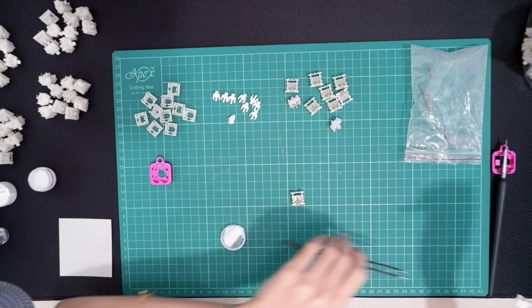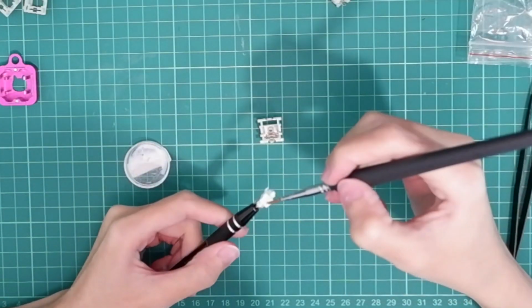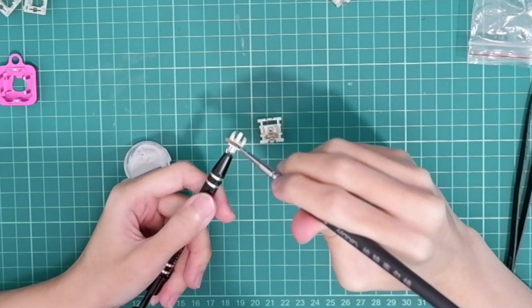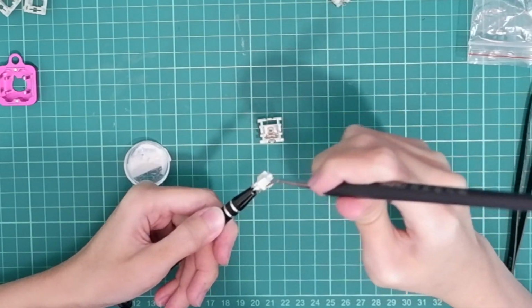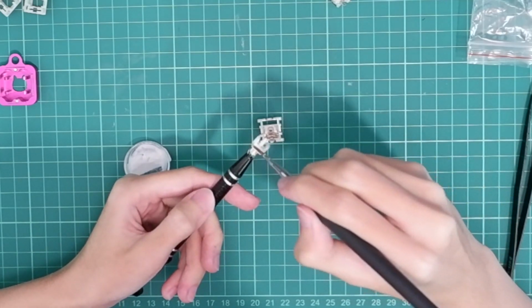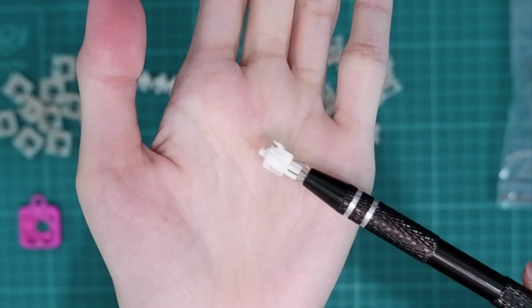For the stem, I use the same amount as the bottom housing, a rice grain size spread evenly. Put one swipe on each side of the stem, then spread it evenly. Since my switches are silent, there's a rubber top that should be avoided. If I lube the rubber, it might get sticky. I also avoid the leg because it's tactile. Make sure that there's no white cast visible.